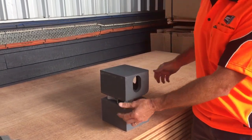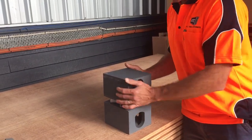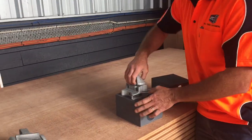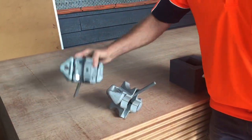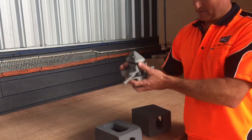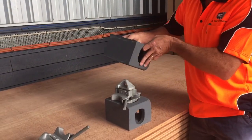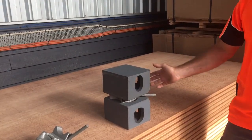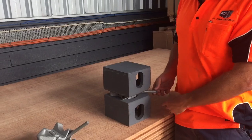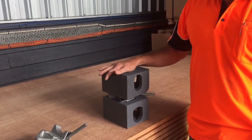I'll also show you the right locking, so the handle is actually away and locked under the container. If we put a right hand locking twist lock there, the handle goes the other way — it's out, poking beyond the containers. So in this instance you'd have two lefts and two rights on one container being stacked on top of another. Thank you.